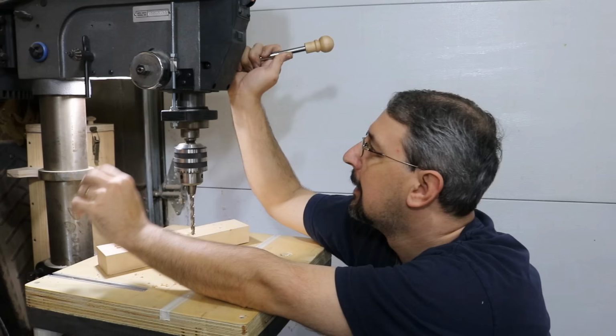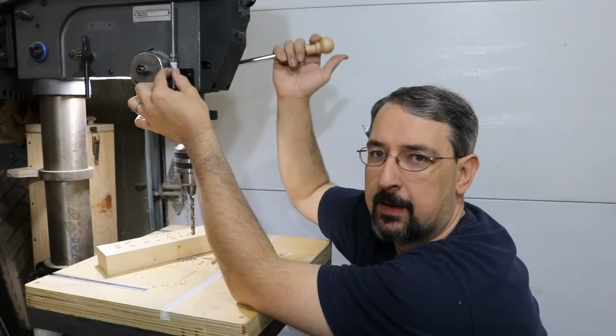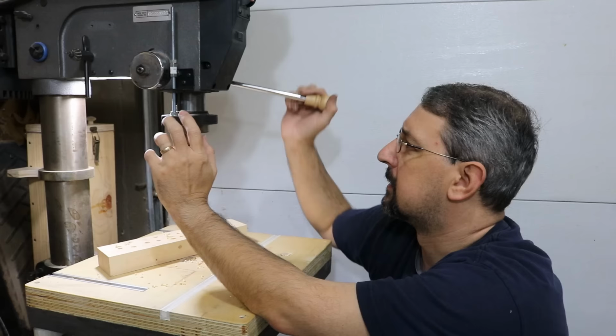Anyway, I might take that nut and actually split it in half long ways and glue them to a clamp. And then I can just put the clamp on there wherever I want it and drill down, and the clamp would hold it in place instead of a jam nut. I seen a picture of that on Pinterest and I thought it was a good idea. I think it'd be more successful with a fatter rod. This is only a 5/16 rod, so that's why I didn't do it this time.